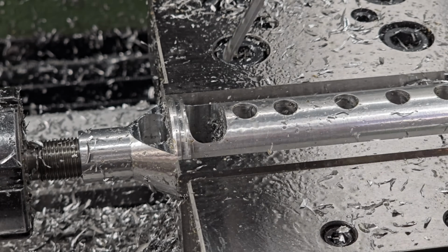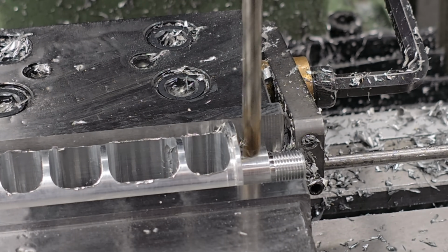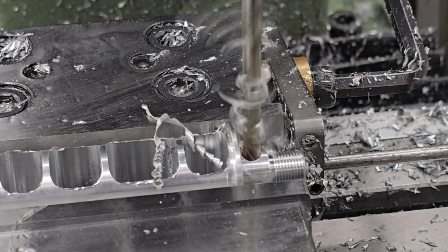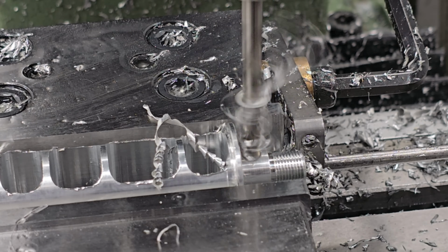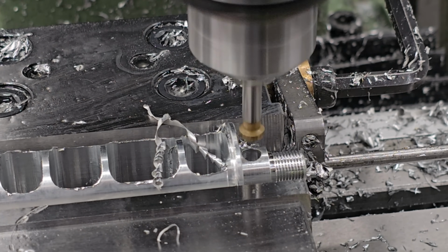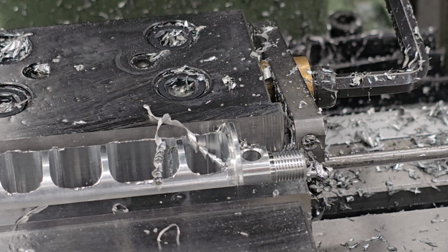With that said, that's all of the baffle chambers milled out. The last thing to do was to drill a hole in the very end. This hole here just allows the air trapped by the front cap to expand back into the baffle core. With that all done, that's the project complete. I'll take you back over to the bench and we'll test it on the rifle.